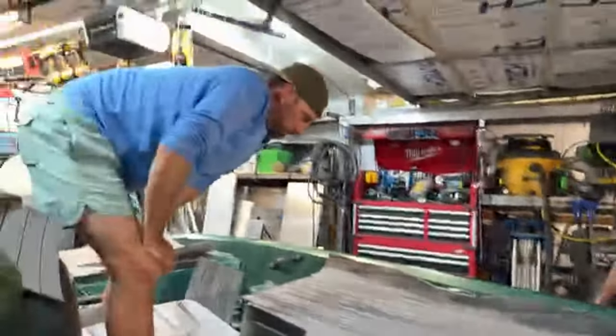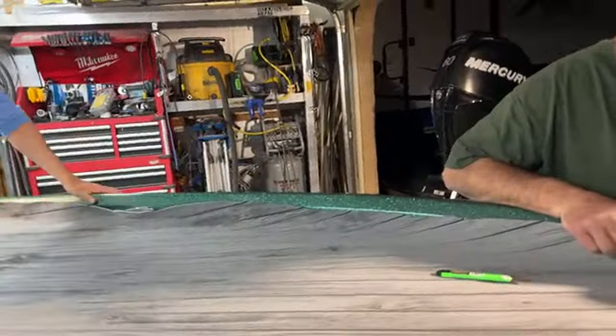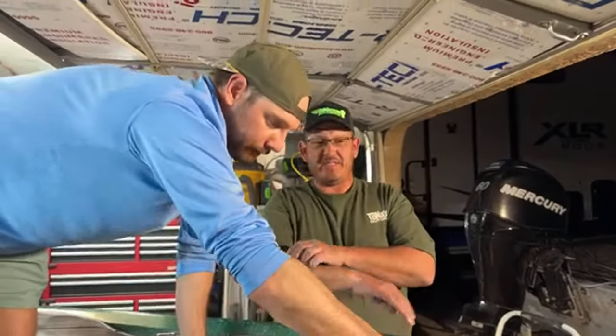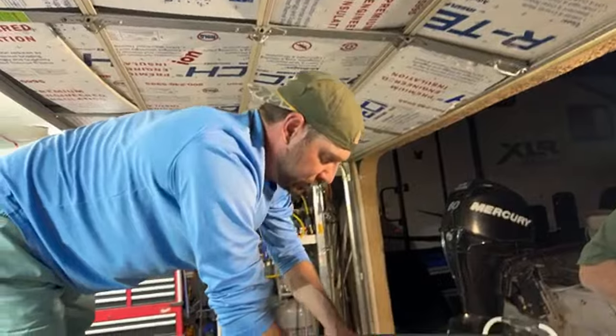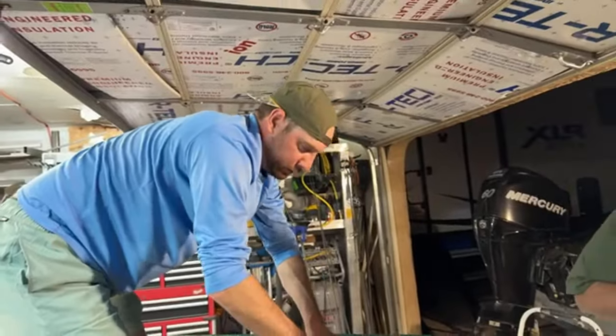Yeah, guys, when you're sponsored by HydroTurf, you just kind of do whatever you want. Normally, I would tell you all not to throw it away like that, to get your pieces and put them back on the white tape there and save them, because you most likely can use them in some scenario. But we're tired and we're over this. On a John boat, you do all the big pieces for the deck and take all your little pieces and seam them together, put them in the compartments. Make all your compartments look great. Or if you're like me and you start saving every little scrap and putting it on white paper, you end up with about 500 of them in a pile and then you just start throwing everything away one day.